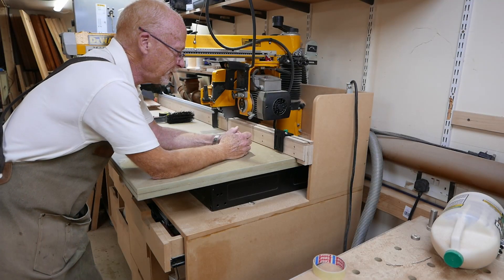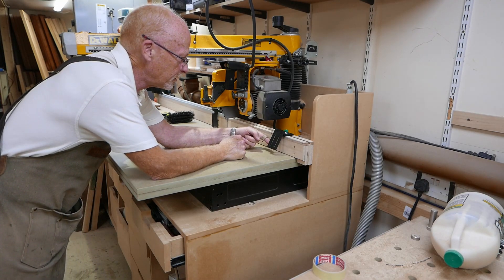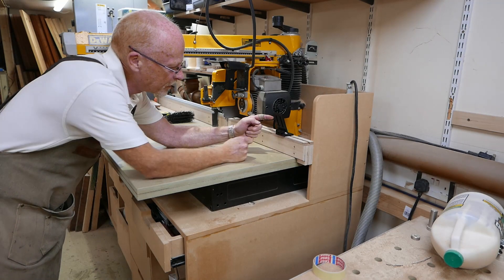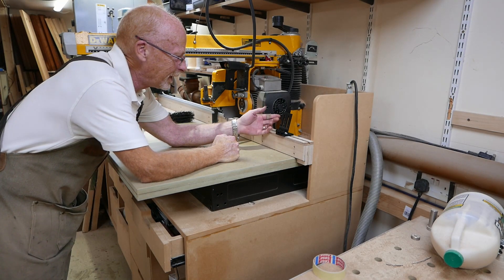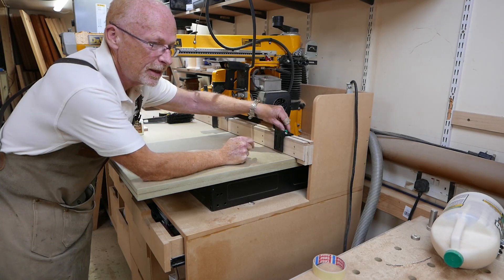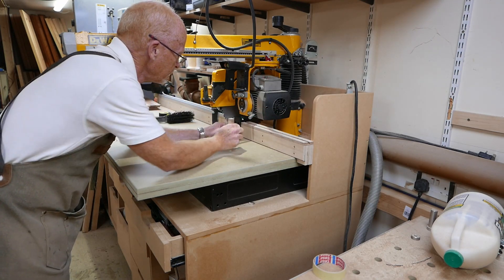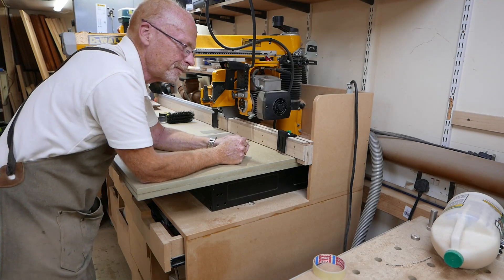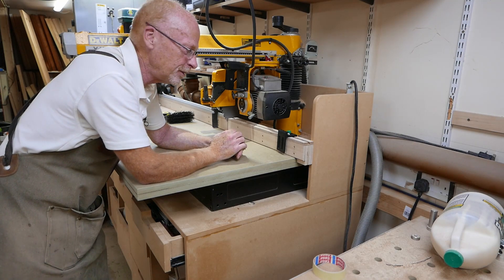And here, fitted, is my homemade 3D printed flip stop. As you can see, the friction from the nyloc nut keeps it in place. It folds up nicely out of the way, back into its own space. And it moves freely — I'd call that a success.